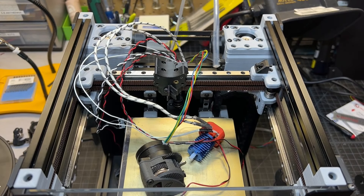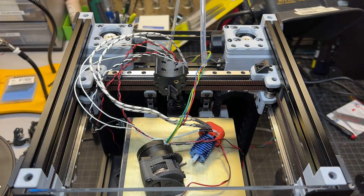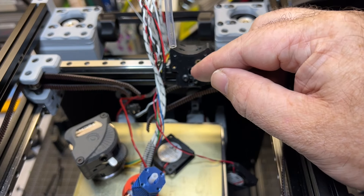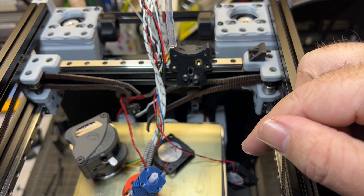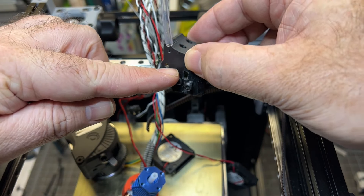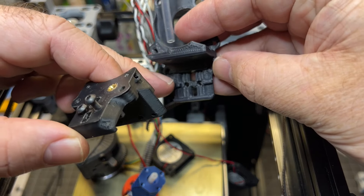We're going to go ahead and remove this next piece — make sure you save the screws because you're going to need those. I got the screws out and took the maker beam nuts out. I definitely recommend taking the maker beam nuts out before you remove the belts, because otherwise you might lose one inside the bottom extrusion, which can be really difficult to remove — so that's a time-saving tip. Something else you need to know: the screws in the piece that bolts to the carriage on the stock mini afterburner are M3x8s, and you're going to need M3x6s instead.